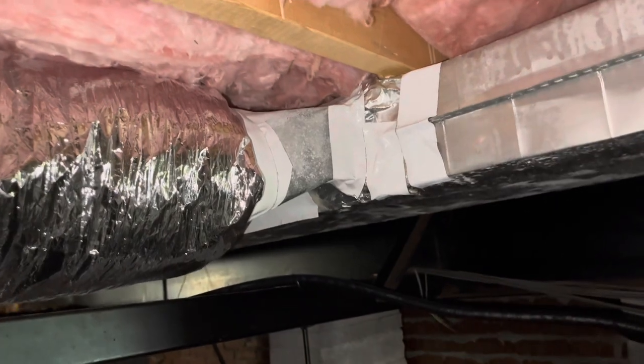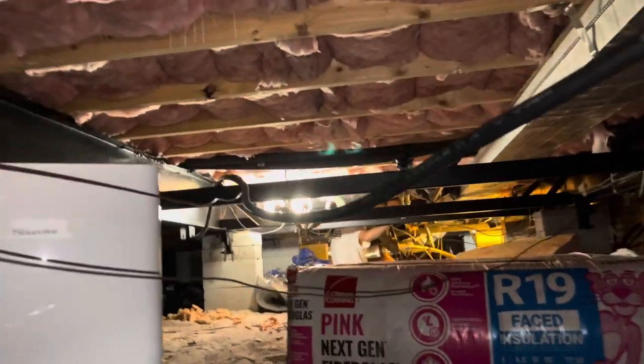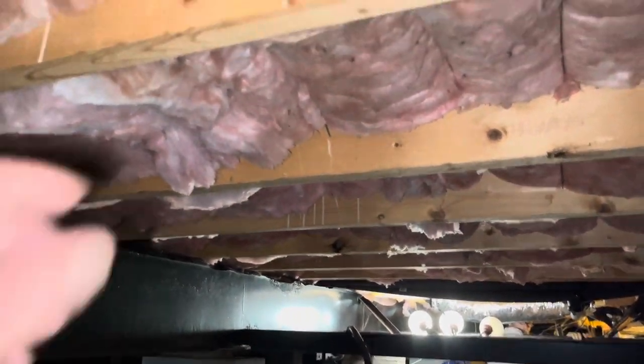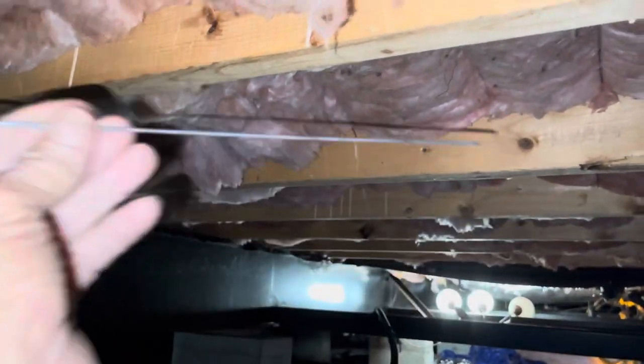Make sure they're not leaking because I'm getting ready to close this in under here. Stick around — we're going to work under here until it's done. I should be making videos possibly daily. I'm putting my mask on, putting my eye protection on, and we're going to go to work. We're just putting the insulation in and we're using these tiger claws to hold it up. You can buy these in your insulation department. You just put it in between the bay and push it up. They sell two different sizes — the 16 and the 24.